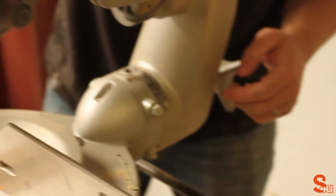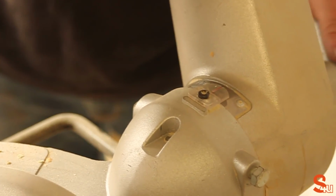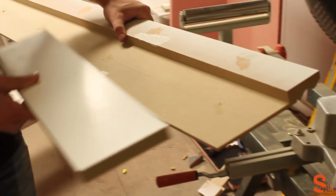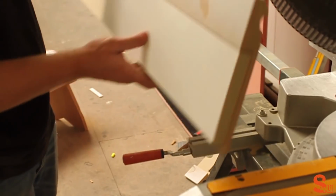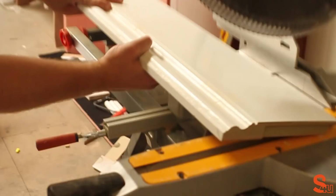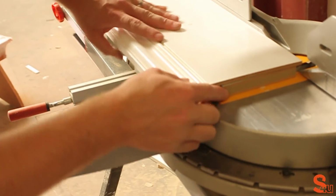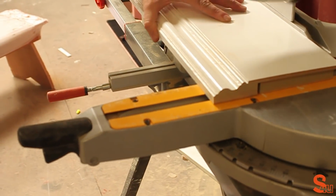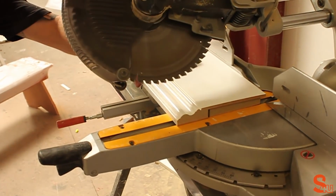And then we turn the mitre saw on the tilt part of it because it makes it easier to cut. Because it's quite a high board, it needs to be done on the tilt. Use an 18mm piece of scrap if you've got one lying around to support the board. It's a 19mm rebate, so that's why we're using an 18mm piece to support it. And this makes it easier to cut for safety reasons, reduces the risk of damaging the board as it's flapping around. So if you have got one knocking around, then that's great. So we're just making the cut here.